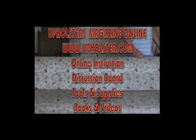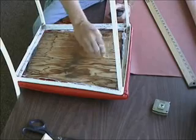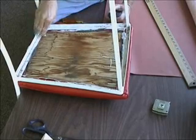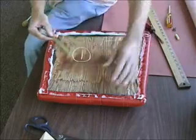I'm going to show you some basic cutting and upholstery techniques and their tools on a simple dining room seat. Before taking anything apart, be sure and mark the fronts of seats and the tops of backs. Also mark screw or bolt holes.